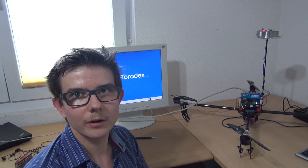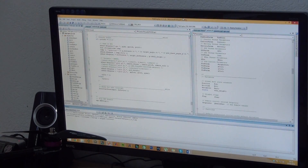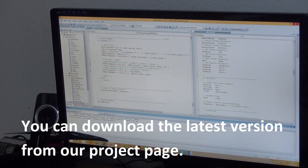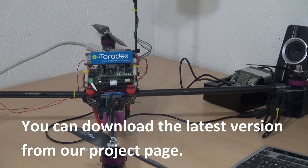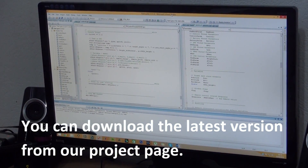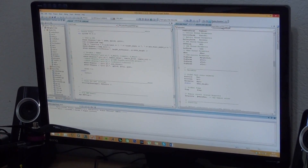So that was a short overview of our hardware. You might wonder how we actually program it — we'll show you the source code in the next video, but here I can quickly show the programming process. This is the graphical user interface we use to stop the current program. Here is Visual Studio, our development environment, with all the source code written in C++. To send it to the quadcopter we use a USB cable directly connected between the computer and the quadcopter. In Visual Studio we specify a Toradex module is attached, then hit compile and deploy solution — just this one button — and in a few seconds it sends to the quadcopter. In the next video we'll show how the control loop works, how the C++ program is set up with multiple threads, how we read the sensors, and all that.